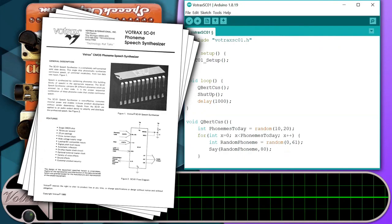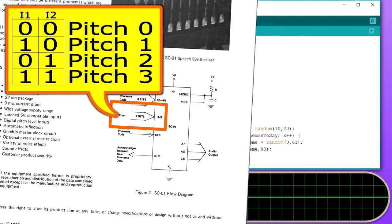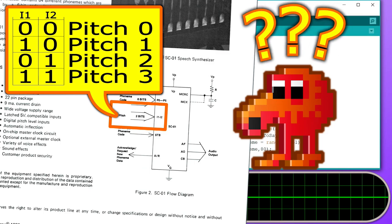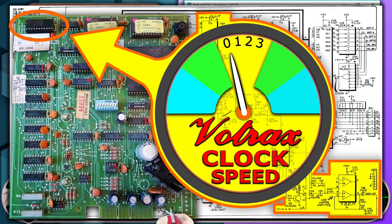But we still need to get the pitch up to Q-Bert's level. The Votrax documentation shows that using two hardware control lines, the SC01 can generate speech at four different pitches for normal speech inflections. But Q-Bert's voice is much, much higher in pitch than any of them. It turns out David Thiel was once again thinking outside the box — this time with a seriously underused feature of Gottlieb's System 80 soundboard, which has custom circuitry allowing game programmers to directly change the frequency of the clock that runs the Votrax. Some may call that overclocking, but it can underclock as well.